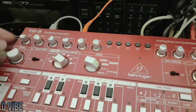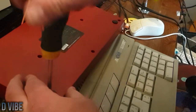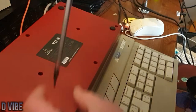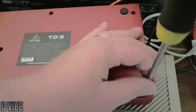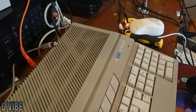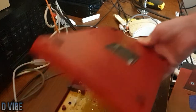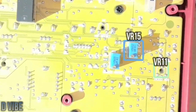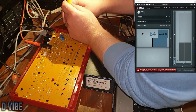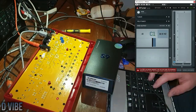So this is what I've tried to do, and this is the result. I started to unscrew the eight screws underneath the synthesizer — it's surprisingly easy to do. After I got it off, I looked for the trim pots VR15 and VR11, which are for fine-tuning the scale, and they were quite easy to find. After about five minutes of fiddling — I'll speed it up because it's boring to watch — I managed to hit a sweet spot.